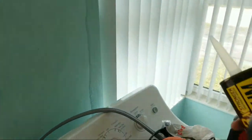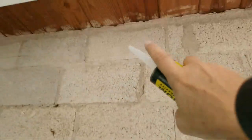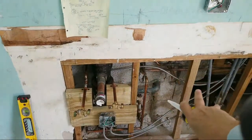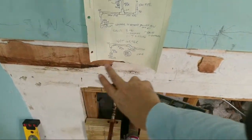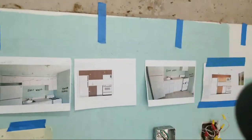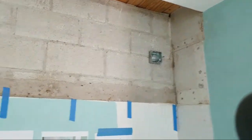I have to put the insulation up there, but before I do that I have to seal all of this right here for fire block. The fire block comes in a tube like caulk — it's about 12 bucks. Wherever there's a hole or any opening, you've got to seal it up. I have foam as well — expanding fire foam. What you're trying to do is prevent the chimney effect. On a stud wall you'll have wood blocks going across — those stop smoke from allowing any kind of fire to spread. All of these techniques just buy you time to get out of the building.